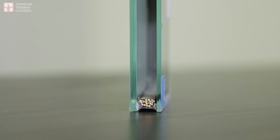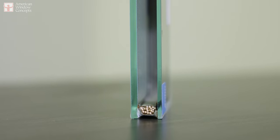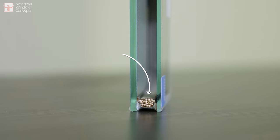You are now stopping that transfer of heat through your clear glass and you're creating what they call a heat pocket between the two panes of glass. As that heat pocket gets warmer and warmer on the inside, it is pushing right on your spacer — hard and consistently — and as it gets hotter and hotter, it continues to push because it doesn't have a way to radiate. When it cools down, all of that hot air begins to cool, and the pressure being pushed on the spacer transfers into more of a suction. Now it's pulling up on that spacer into the glass panel area.